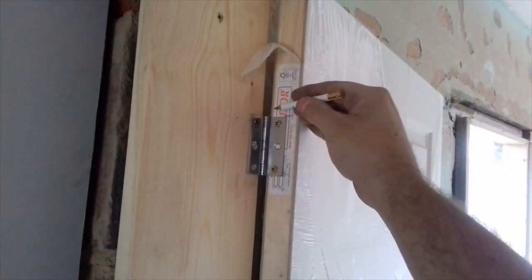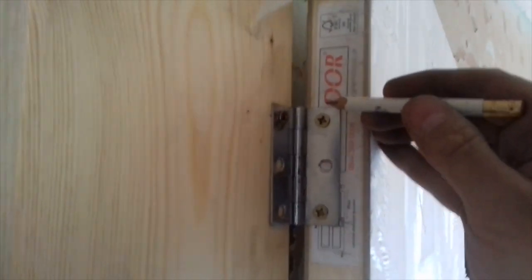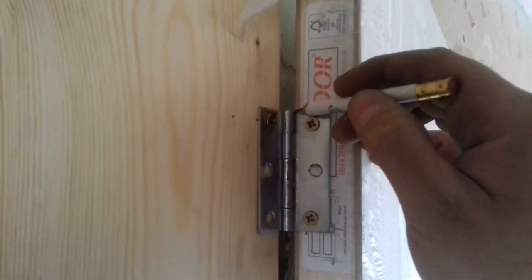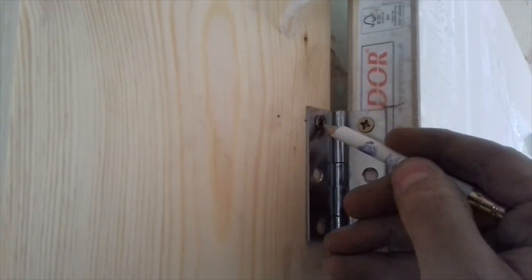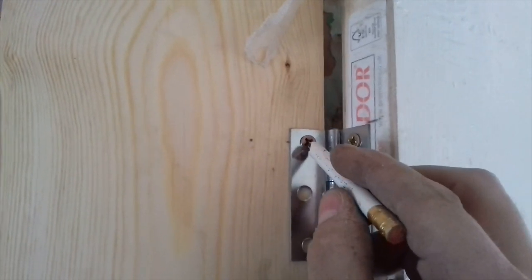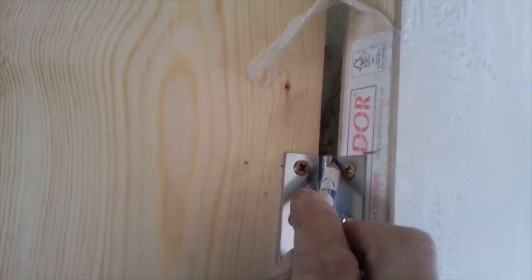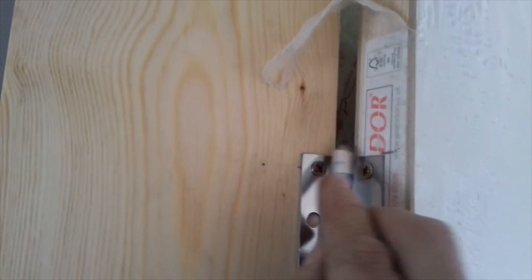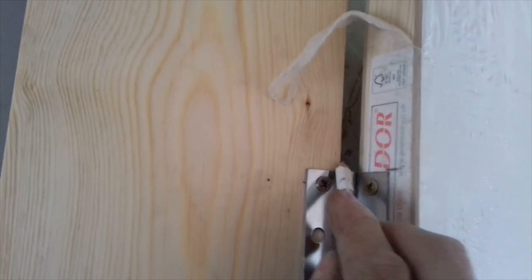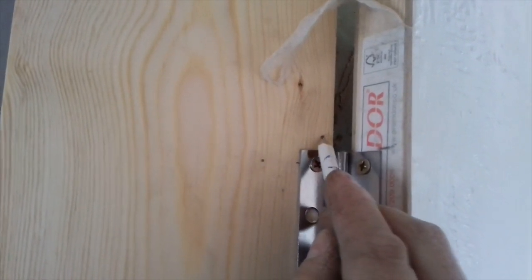When you actually put a hinge on, you want to see this section here — the actual hinge. That part of the hinge is aligned with the edge. If you're unsure where to actually drill your hole for this side, if you imagine that edge is in line with this section here, that is where you want that edge to be on the door, because you want that corner to marry up with that corner. There's no point having this edge levelled here, because then your finishing edge will actually finish inside, not at the same level. Just a bit of a heads up on that one.